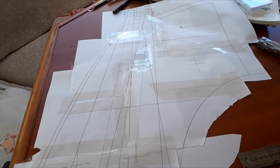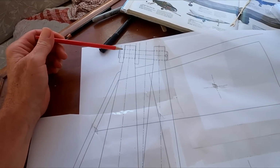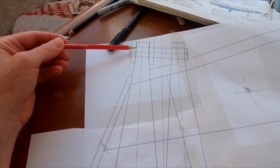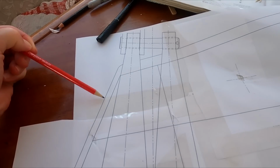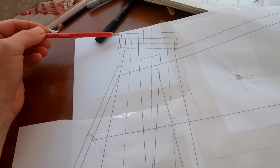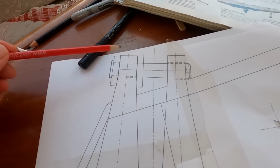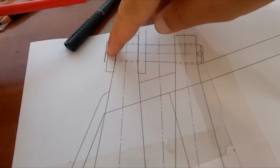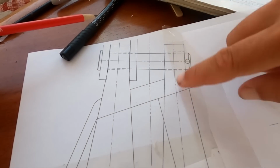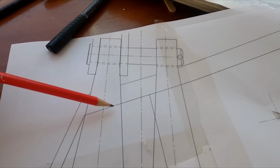So this is your to scale template for our new carbon fibre chain plates. You can see this is the deck here, the outside. This is the toggle for the stay. This is the lowers. So, toggle for the side stays, the main pin that goes through, and then the lowers will get lashed into the extension of the pin into the second chain plate. And then it goes through the deck.